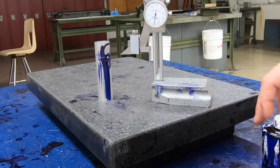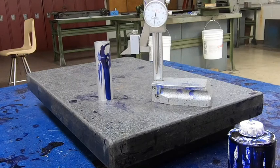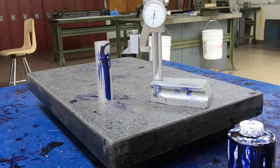Double-check that the lid is on the bottle of dye. Now you're ready to go back to your lathe and start turning that first section down to 0.875 diameter. On automatic feed, stop short of that line and then move it in by hand the rest of the way. Stop about an eighth of an inch before the line, then use your hand wheel to crank in the rest. The goal is to just barely leave the line — if you take away the line, you no longer know how far to go. There will be another video covering the step-by-step machining process as well.